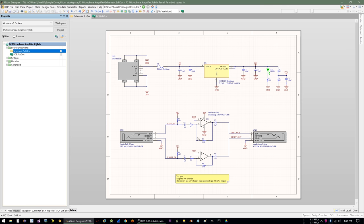And then I have the op amp. Basically it's comparing the two voltages. It's comparing 1.65 volts to what it's getting from the microphone. And what it's effectively doing with the 180K and 3.3K resistor is I have a gain of about 55, which I experimented with earlier on some breadboard stuff, and that seems to work out pretty well. So these are basically an amplifier that applies 55 times gain, and then the output is AC coupled with a 1 microfarad capacitor. And it's all duplicated for the left and right channel, exactly the same, and then it goes out to the connector in the back.